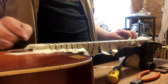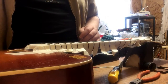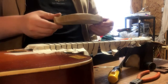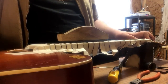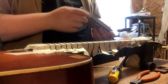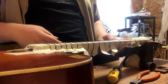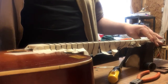Just fantastic for leveling fretboards and leveling frets. For quite a lot of time I was using a file that I put to an ash handle that I made — it did a great job. It did the job, but the problem was the file I used was very rough, left a lot of scratch marks, and it took a lot longer to take those marks out. Sometimes if you slip you're gonna hit something and leave a really big mark. It got the job done fast.